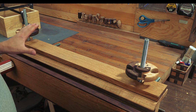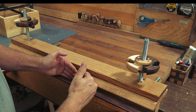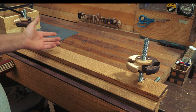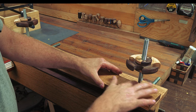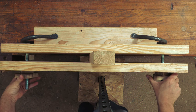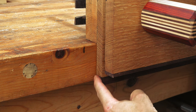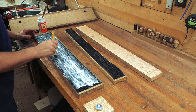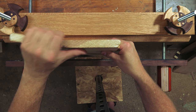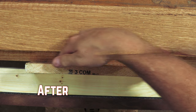One problem that threatened this entire project was the idea that I'd have to remove the knobs every time I wanted to add a board, because you don't want to worry about cutting into the top jaw. To fix that, I made my cuts all the way to the end, and it still works fine because the knobs are wide enough to support that cutout. The next hurdle was the bulk of the vise. Because of the pressure needed to hold things in place, having thick jaws is the only way to prevent deflection. First, I used my bench to strengthen the back jaw and formed it against the table — like adding a really thick board — so the stock used here doesn't need to be very thick. Second, I added tracker rubber to the inside face of the other jaw, relying on the grippy surface of the rubber rather than jaw pressure alone. For unruly stock that needs flattening, we can still get the pressure we need by using a cambered caul on the front jaw — the center point presses inward and easily straightens things up.